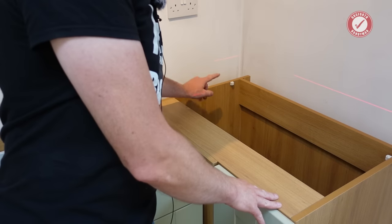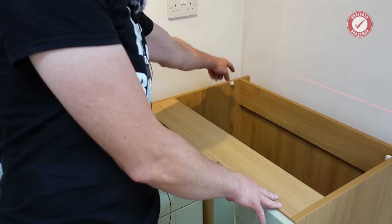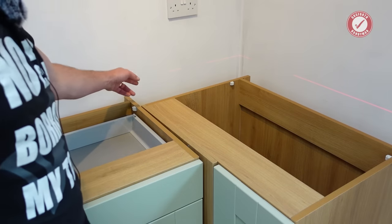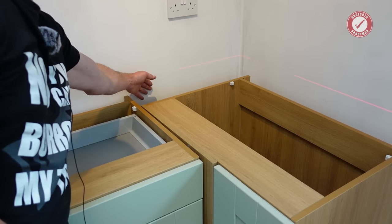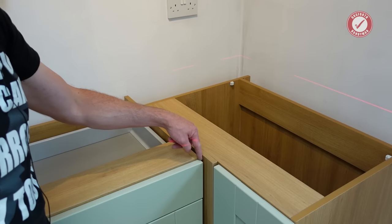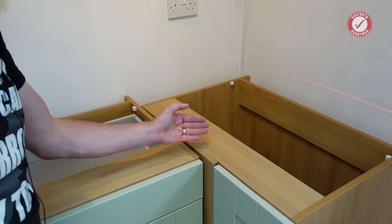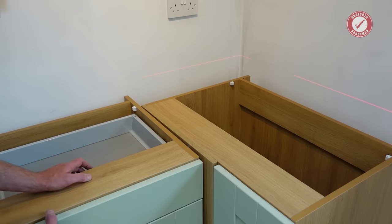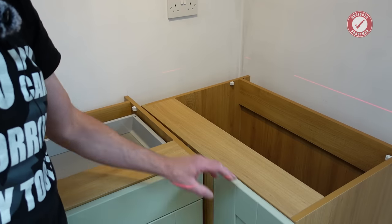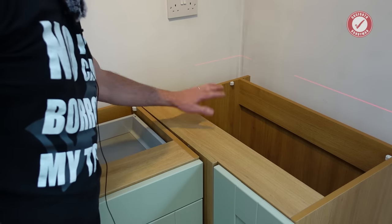So this is a corner unit and it can't go back against the wall quite yet because I need to do a little cutout for the water pipe for the outside tap just right down at the bottom of the unit. Once I've done that this will go against the wall, but what they suggest is a 130mm gap between that side panel and the wall, and a 30mm gap between this panel and this panel, and then you have a little corner fillet in here to fill up this gap. This bit comes off, you just move it along a bit and then reattach it. If you don't do that, when you open your drawers they'll hit your handles of this cupboard — so it's really important. That's how corner units work.